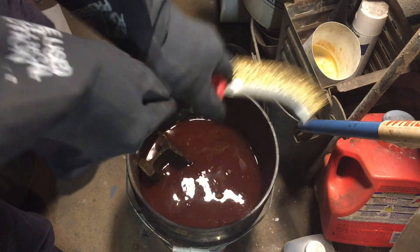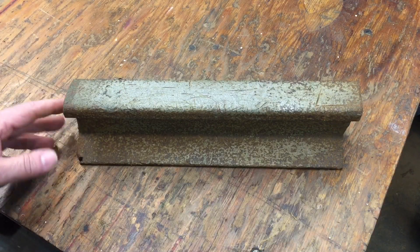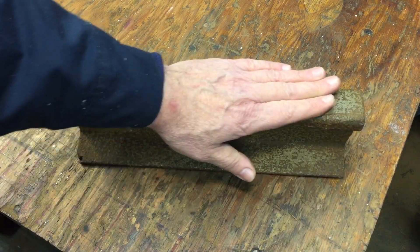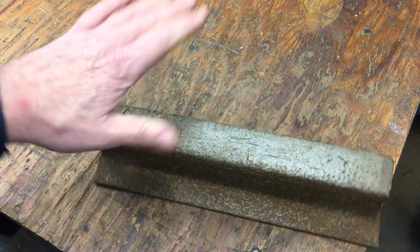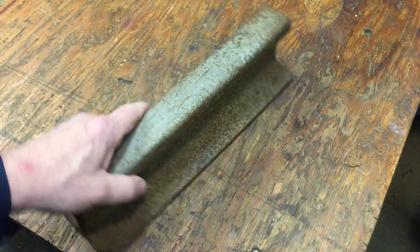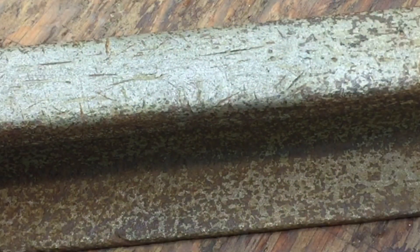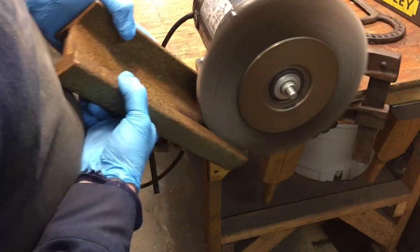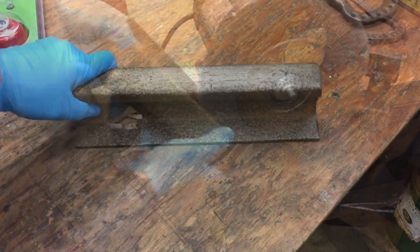You have to do that between about every eight hours — soak it and brush it. Here we are after two and a half days of soaking in vinegar and wiping it down with the stiff brush. You can see a lot of the rust is off. There's still some massive pitting, but this is a perfectly usable anvil in the shape it's in now. But we're going to take off some more rust and get it clean so we don't feel like we're getting rust on our hands when using it — to do that we'll use the angle grinder.